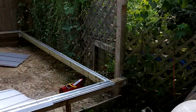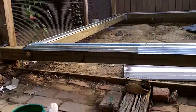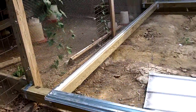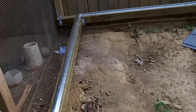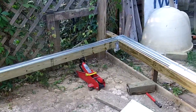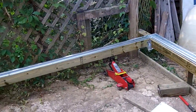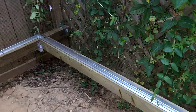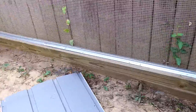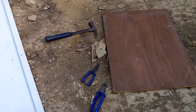Larry came by to help me finish up this framing. I got it all up off the ground now. Got my rail set and I only got a couple of set screws in the rail, because when you put the panels up and start putting the roof on - they're all pre-drilled holes - and if it's just a little bit out of square those holes won't line up. So you gotta pull your set screws out and caddywampus it a little bit left or right until your roof panels line up. This was a used shed so the bottom was all dinged up - got my metal shed straightener tool and straightened all that up.